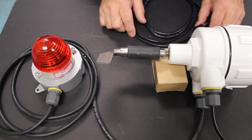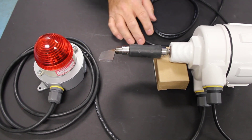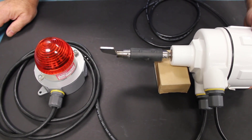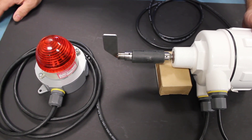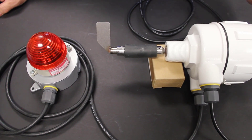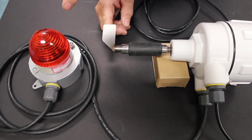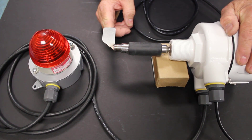Now that all wiring connections are made, we're going to power the system up. I'm going to plug the 115-volt power cord in. The paddle is going to rotate — it rotates at 1 RPM. We have an assortment of different paddles; this one is a smaller paddle meant for heavier product like aggregate that can stop a smaller paddle. The light is off while the paddle is rotating.